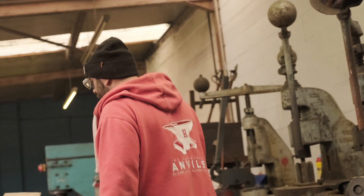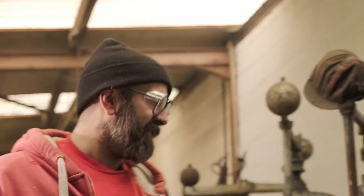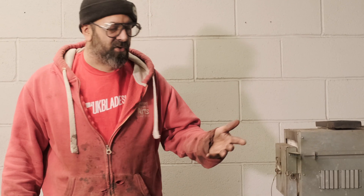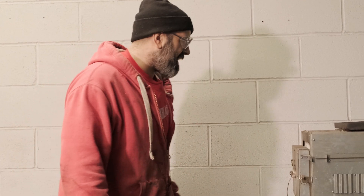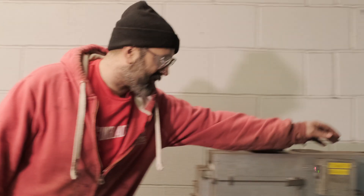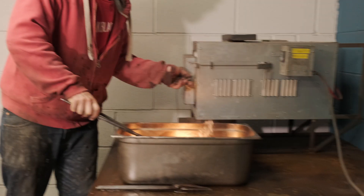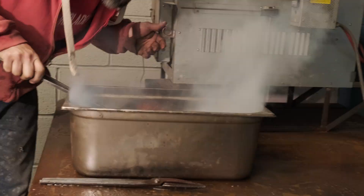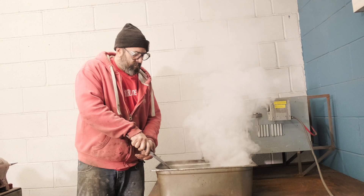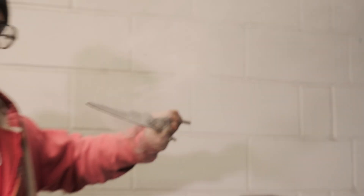That's up to 830. I'm just going to check my timer to make sure I'm not going in too early — I'm going in too early, so I'm going to wait. Patience is a virtue, one I'm not very good at. We're at the right temperature now. I'm going to flick this off and quench. Oh, look at that — it's straight! Who knew?